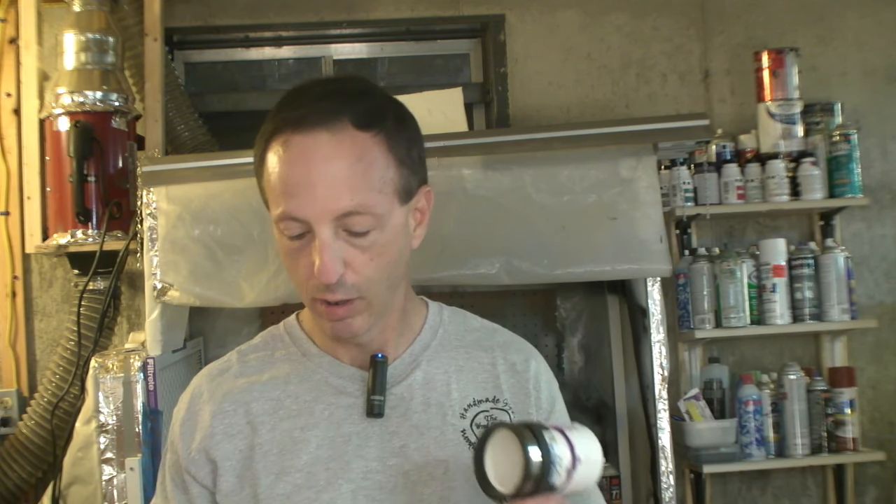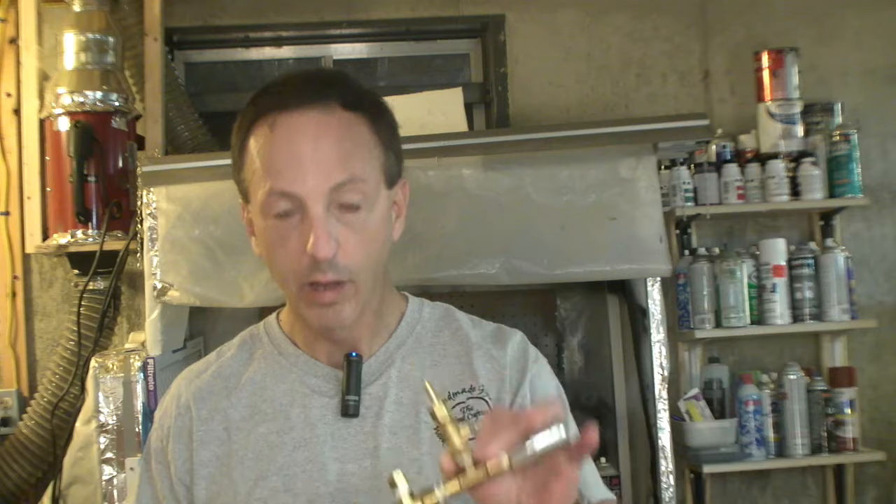I'm actually going to put two of these into the sanding table because it's not unusual for me to sand more than one part at a time. So you'll see how we use a boot — here's a big one, three-inch — some PVC, and the cap. Most of you who do plumbing work already know how to join all this stuff. We'll go over the details of the manifold, though it doesn't have to be a manifold. You could make this a single port to connect up to your vacuum pump.